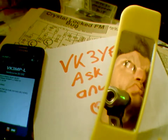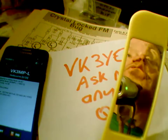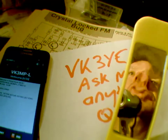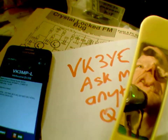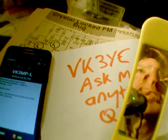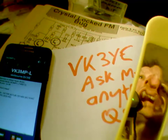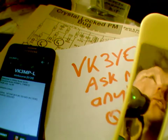Now, have I played with the long wave band? I have not, quite long wave. It's still technically medium frequency, but yeah, 473 kilohertz. I have transmitted WSPR. In fact, I think I might have transmitted CW once. So I built a CW transmitter, haven't properly got it on the air, but I have transmitted WSPR using a WSPR transmitter kit from Sweden. I reviewed the Zactec, that's right. Anyway, I could get it to transmit on 472 or 3 kilohertz, whatever it was, and that was successful. I was just using the G5RV. I had this big loading coil on the lounge room floor, and I was spotted about 400 kilometers away down in VK7. I did a video on it at the time.